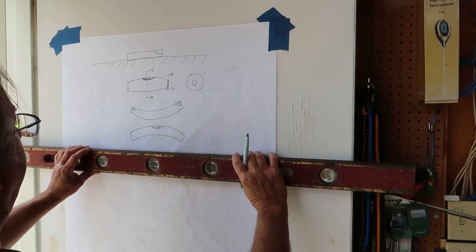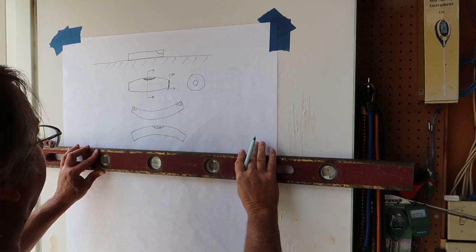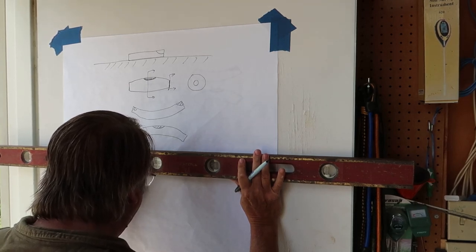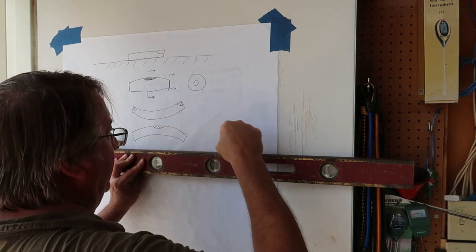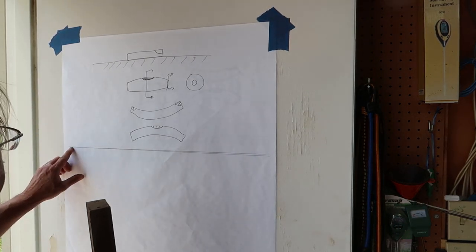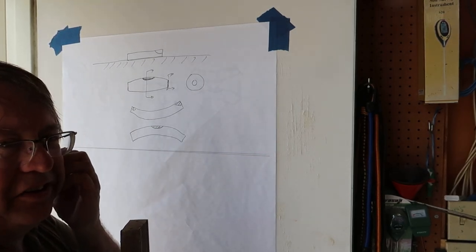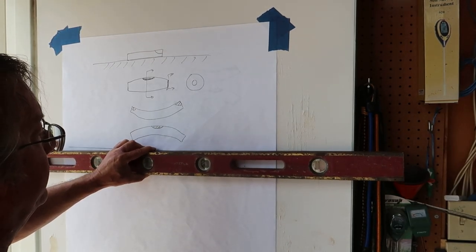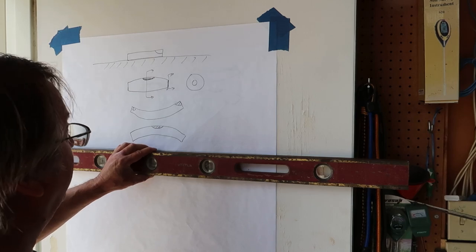And the way I do it is I cover up the line barely, so I'm not looking at it, I'm not biased by that line. So I can't see a line. I go back to my bubble, get it level, push it tight, and voila, it's close. It comes to a point here, they actually touch, but the lines start diverging. Is that a lot or a little? It's probably less than a degree. Probably good enough for the woodworking that I do for shelves and such. If you're a surveyor though, that's probably not good enough.